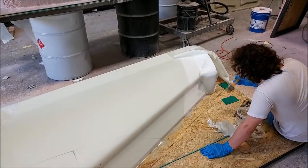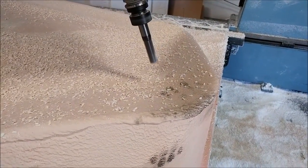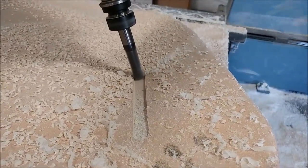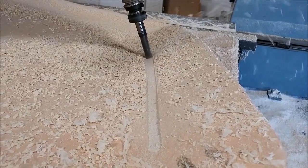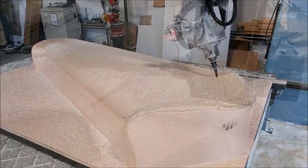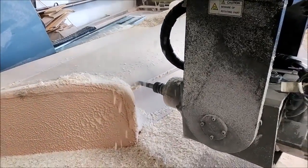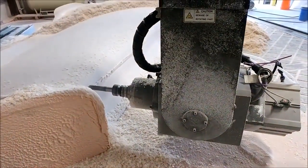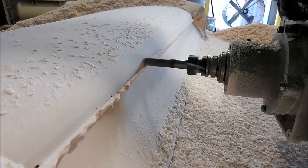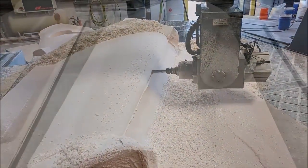This is the right hand side upper wing strake in putty, ready to have its final milling done. This is just the first cut starting out on one of the areas of the flange. Jeff's got just the right amount of putty — no low spots and not too deep — so that one went fairly smoothly. Here we're a little bit further along doing the leading edge with the short flat mill. The machine is so dialed in now that the surface is perfect; it just needs a light sanding. It's really smooth with no ridging at all — super happy about that.